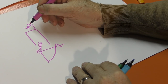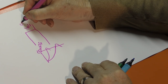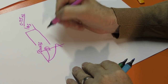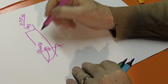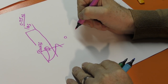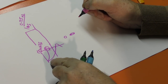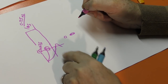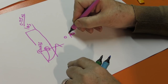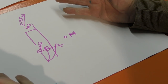I happen to have a very good power supply in both my machines, and I know that I can get to that value in around about 0.25 milliseconds. How do I know that? Well, because although we've got a 1 millisecond time period, I can get this little spike here, this little burst of energy which is just enough to produce a dot, and then it disappears. Although I'm asking it to print a pixel, I've got a little squirt of power that is so slow coming on that I just about get to the end of the pixel and I get a little pulse of power to burn a dot. Whereas with the RF, it turns on instantly, I get my power instantly, and I get a line and not a dot. That's the difference between these two systems.